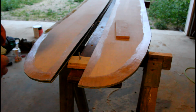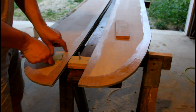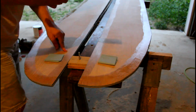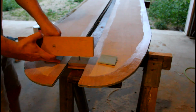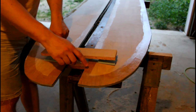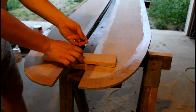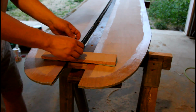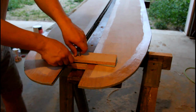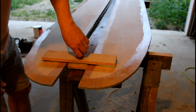Now, like I said, that's a 1/2 inch. It's a little too thick. If I just clamped a board down on there, it wouldn't work, but folded up Scott towel here keeps the clamping pressure out here outside. I don't want to clamp down on this. When I'm going fast enough, this stuff will actually be tacky enough that it could glue the spacers on, so you don't want to do that. Putting the pressure out to the sides a little better. I usually make sure that my newest face is up too, so I don't have to worry about the glue down here sticking to it as much.